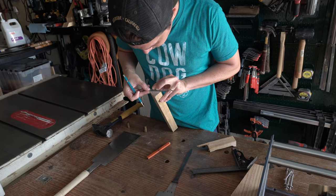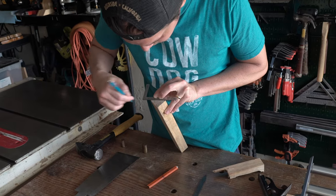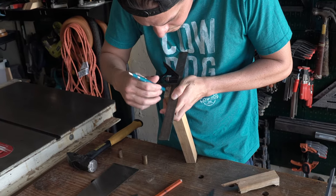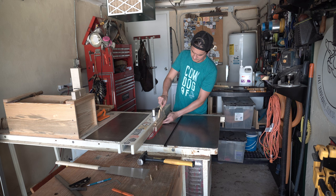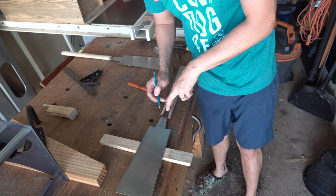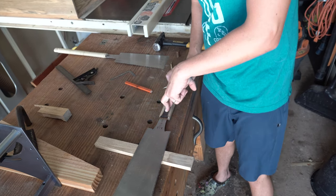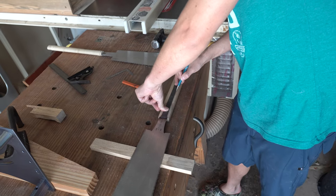Now that I've got stock for a handle at approximately a foot long, I'm going to mark center and rip the board into two pieces on the table saw. This doesn't have to be dead exact, but it should be pretty darn close unless you want a lot of extra work on the back end trying to shape it down to size. Then using the actual tang of the saw, I'll pick a side and trace it out, and use a marking knife to scribe a line all the way around.